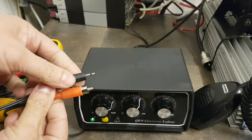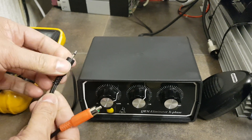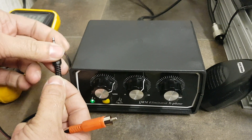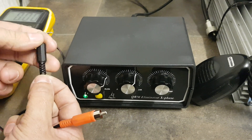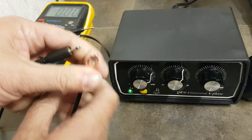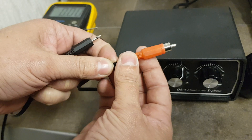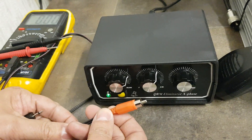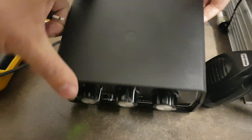The PTT cable — the jack wasn't supplied, it was soldered by me. It's a 2.5mm mono jack. You can find them on eBay to plug into the VOX jack, but don't bother, because it doesn't actually work. The seller told me to plug into VOX, but he speaks Russian and I used a translator — something got lost in translation. I think this is an open circuit, and I'll show you what that means. This might work to plug all X-Phase units onto your radios.